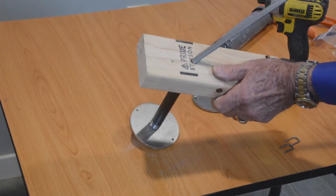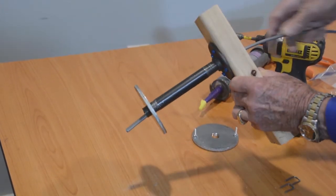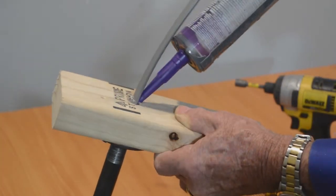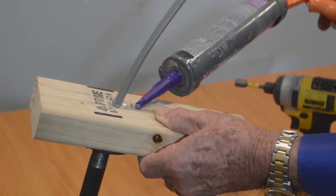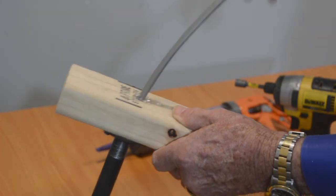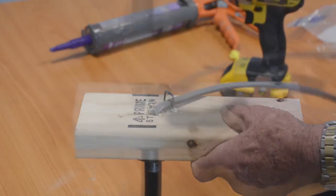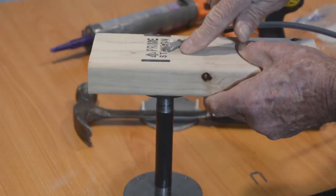Pass a length of UFB wire through the board and pipe, leaving a generous amount to wire the fan. Seal the wire into the board by filling the hole in the board as far as the nozzle will reach, then leading some of the sealant away from the hole. Bend the wire down into the sealant and fasten with the supplied staple. Smooth the sealant around the wire.